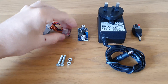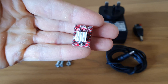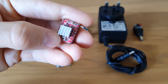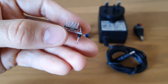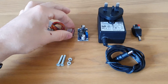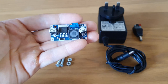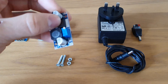Next we have the A4988 driver board, which allows us to drive this stepper motor at 12 volts. You can see there's a little potentiometer just there by my thumb which allows us to limit the current. They also come with heat sinks — I would suggest using the heat sinks because they do get very warm. Next we have the LM2596 buck converter board which will allow us to put 12 volts in and get 5 volts out, which will power our Wemos D1 Mini.